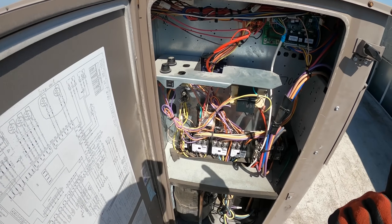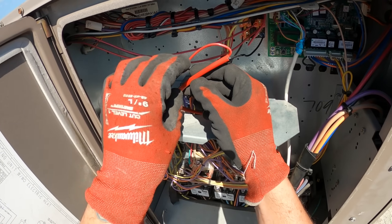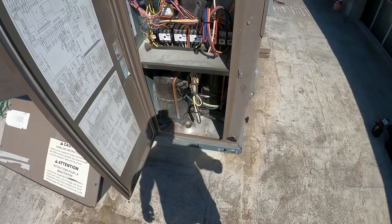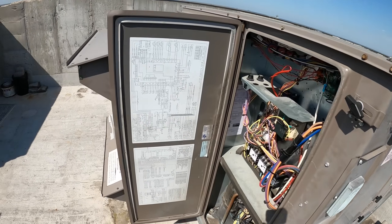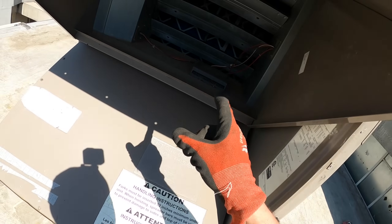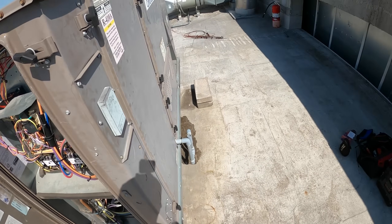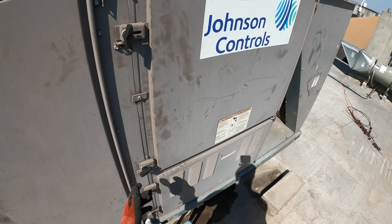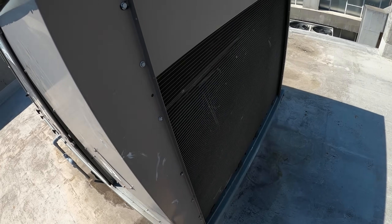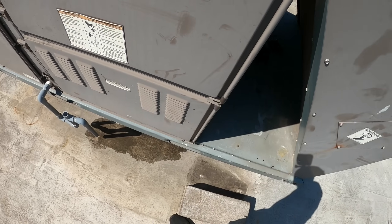We've got communication failure on the economizer because the SA bus is done. And I've got to call back about the fire alarm wire — it's disconnected and I've taped it off for now, but something needs to be done about that. We found dirty air filters and replaced them. We found a broken belt and replaced it, leaving a spare on site. We also fixed the vibration from the loose screws. This coil is probably at least $7,000 just off the bat, not including labor.